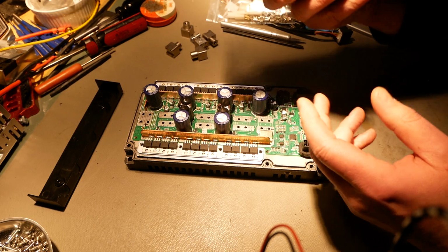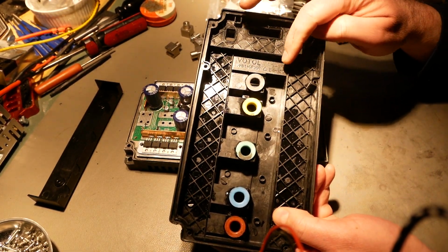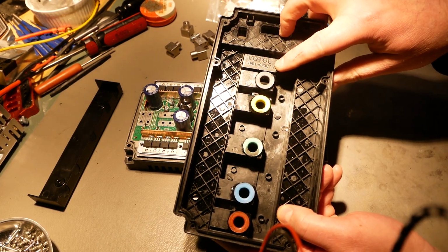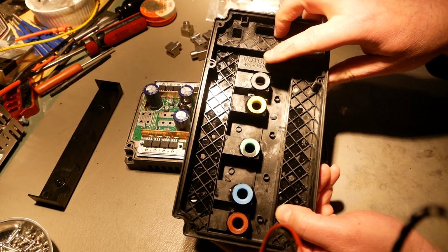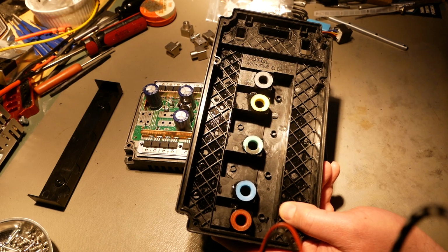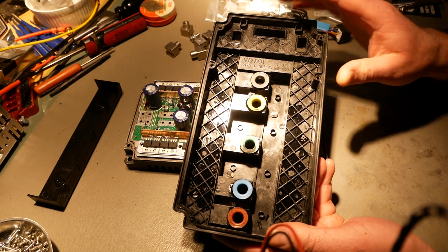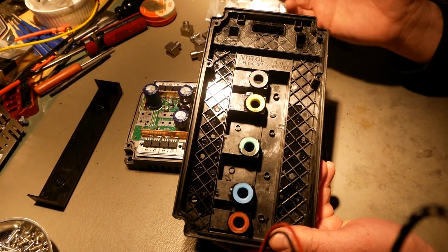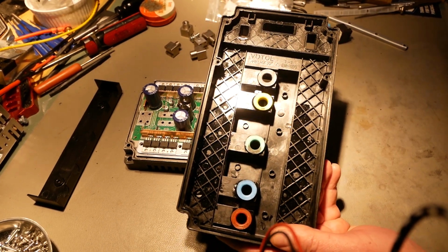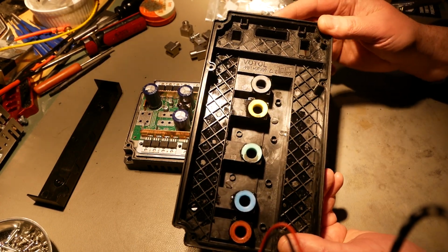And so let's start looking inside. As you can see right up at the top, it says Votol, it says EM-150, and right below it, it tells you the kind of plastic. So PBT plus GF30. This is a specific chemistry from a company called Ensinger. GF30 indicates glass-filled 30%. So this is glass-reinforced plastic, which makes it very tough. And PBT is specifically polyester. And this is their branding for that, this Ensinger company.